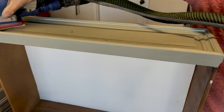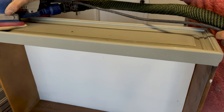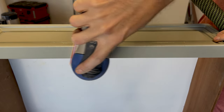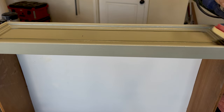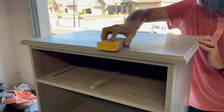I'm using a fine pad by Surf Prep for the sanding — just a foam pad. I'll do the curved surfaces with that, and then I'll hit the flat surfaces with a rigid foam pad by hand, wrapping a 320 grit block in that to do it.